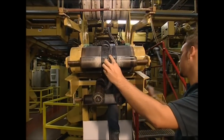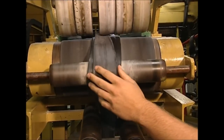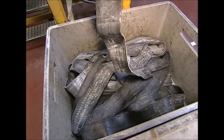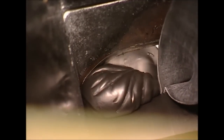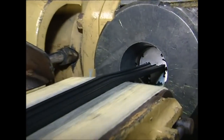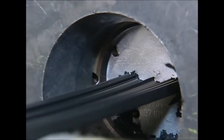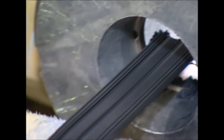The arms are sent to dry, and the process of turning the fresh rubber into wiper blades can now begin. The raw material is squeezed into an extruder, which forces it into the right shape to make a continuous band that, when cut in half, will form two separate wiper blades. At this stage there would be very long wiper blades, but this is only the beginning of the process.